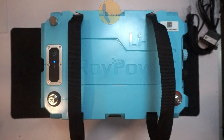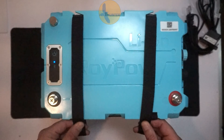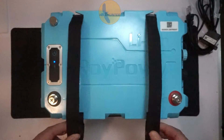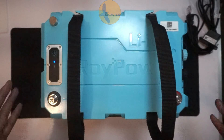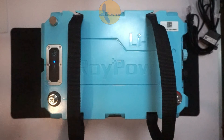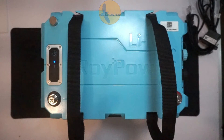They work well in both cold and hot temperatures, but you should never charge a frozen LiFePO4 battery. The 24V version does have a heating system that will warm the battery up so it doesn't get too cold to charge. But with the 12V one, you cannot charge it outside if it's frozen — you need to bring it inside. That's an important feature to remember.